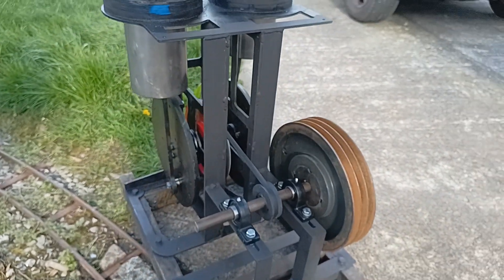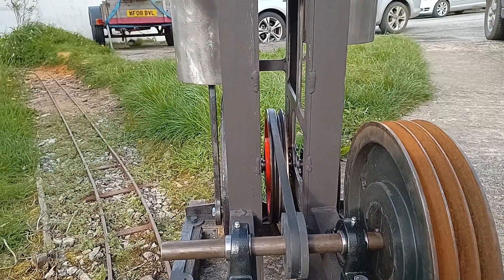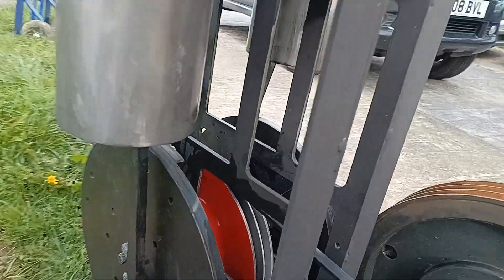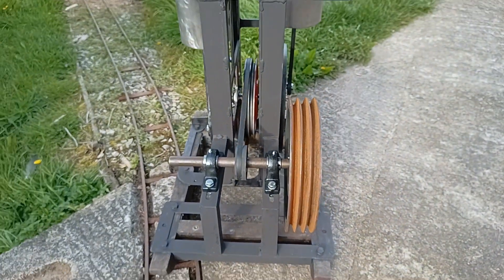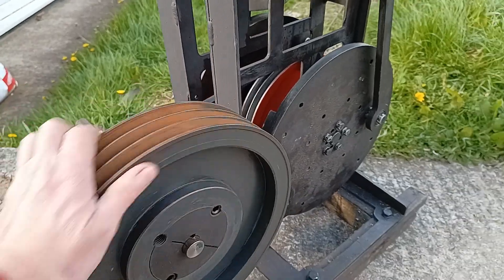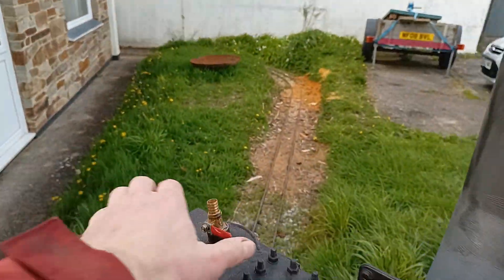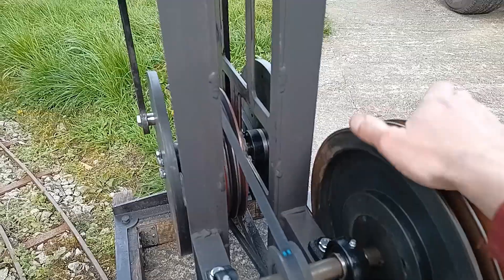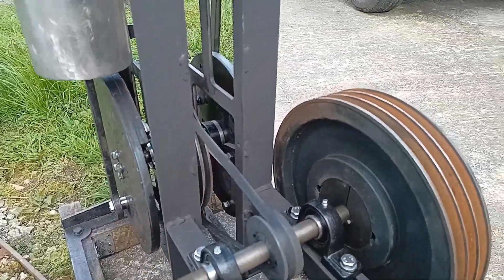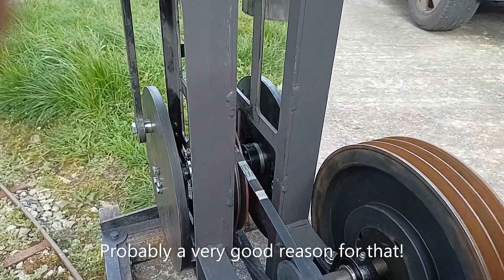The other thing I was thinking was that the flywheel is not quite big enough. The design is a bit problematic to add a bigger flywheel to in the middle because there's not really much room to add anything of substantial weight. What I've done is I've got the big red pulley there, fitted with a v-belt going to a smaller pulley which is half the size, and I've acquired this rather large pulley-stroke-flywheel which weighs a fair bit. So now it is geared up. I've only ever seen a flywheel that's geared on a few occasions.